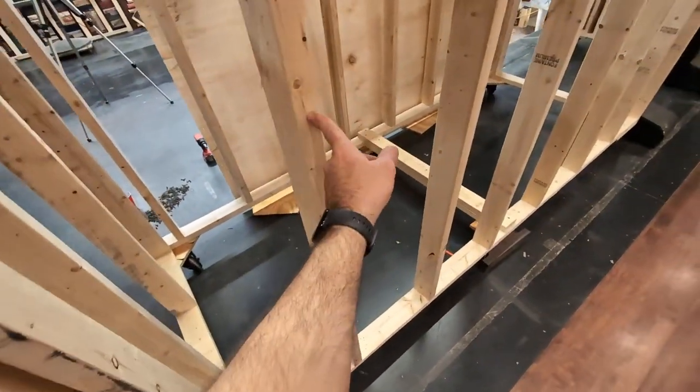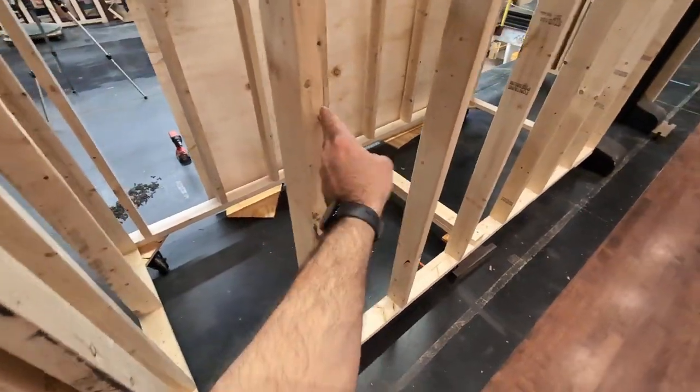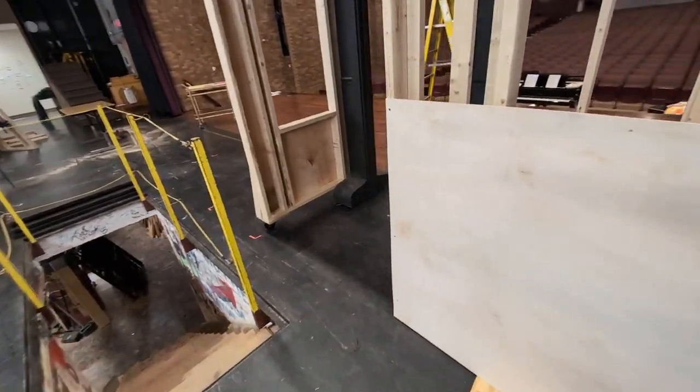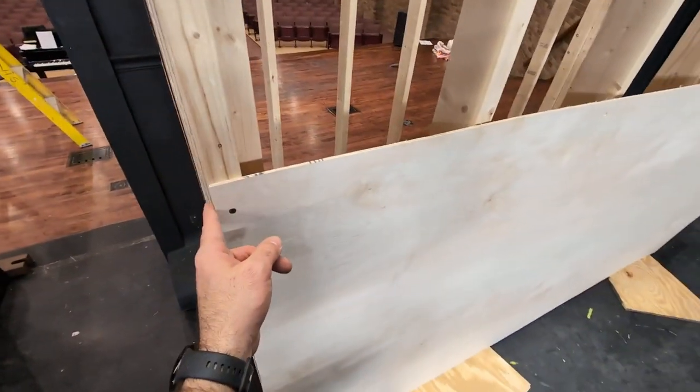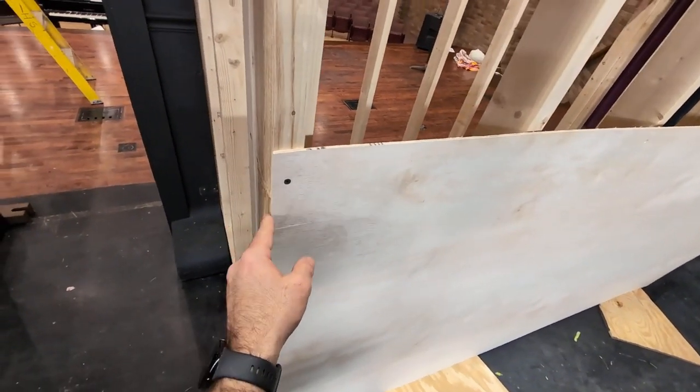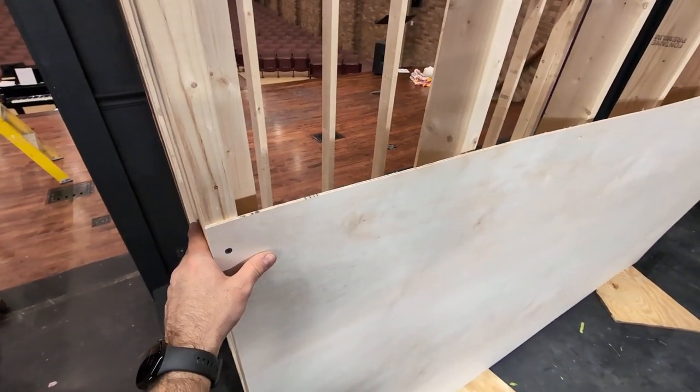Well, we won't, because we're going to stop in the middle of this one, and then we'll make a piece from here to the center of there. That's another consideration when you hang drywall, because you're going to use trim. You can start back 3/4 of an inch, and you end up obscuring that. But I want this to be a nice, what looks like finished outside drywall corner.